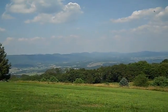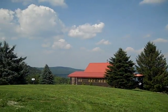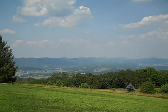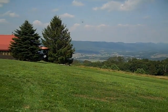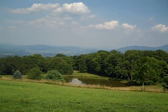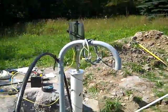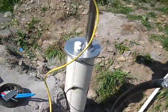Hey YouTube, up here in an undisclosed location — a beautiful spot on a mountain ridge — working on a retreat. We're working on water today. We had a well drilled here at this site, and the owner wanted to put a simple pump on. He also has a spring box with an existing submersible pump in it, so we're going to leave that in and tie this well in. This well only produced two gallons a minute; it's 405 feet deep.